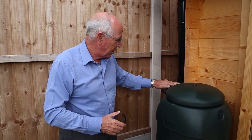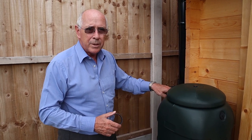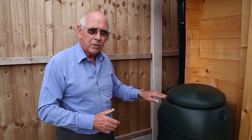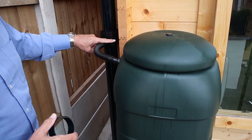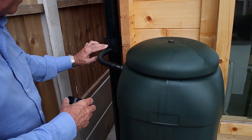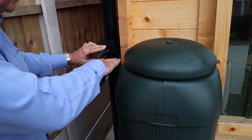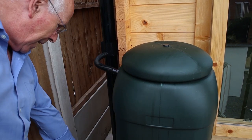Now the water level is going to be measured below the top of this barrel, which means that when the barrel fills up again it will stop just below the surface. The pipe is cut through here and sits inside this box — by cutting this piece out, it's dropped the box down, which drops the level at which water goes into the barrel. Once it reaches that level, it flows over the top and out through the bottom of the pipe.